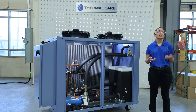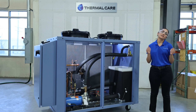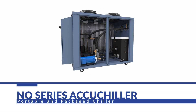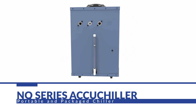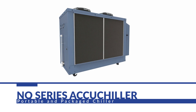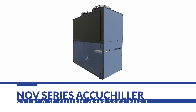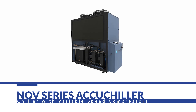An example of how this might happen is if you have flow control valves that are based off of temperature and they start to throttle down. Thermal Care chillers include built-in safeties that will shut the chiller down in low flow situations. However, situations can occur where your process set point is low and flow is trapped in the evaporator itself. In situations like these, we could run into freezing damage that could cause catastrophic issues to the refrigeration circuit itself.